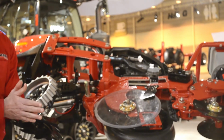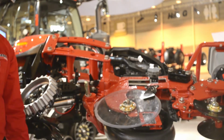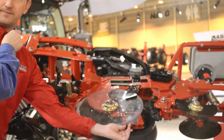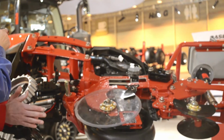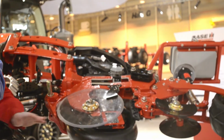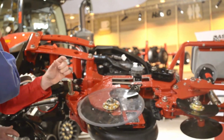It's very good for penetrating hard soils. We don't need a no-till coulter out in front of this system. Then it comes with the separator right behind. That's right. And then back here you see this furrow forming point and a seed shoe. Anytime you have a set of double disc openers, you create a W in the bottom of the trench. So this little forming point gives you a flat seed bottom to your furrow, so when you drop a seed, you very consistently drop it to the same depth all the time.